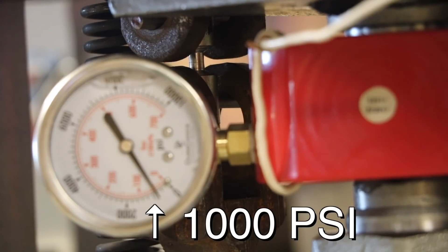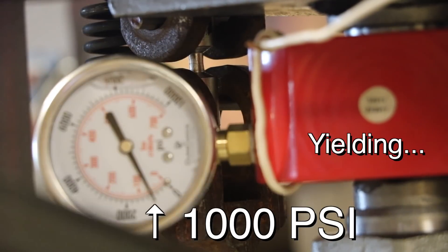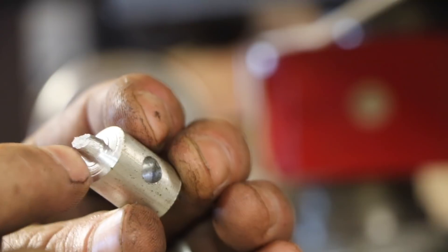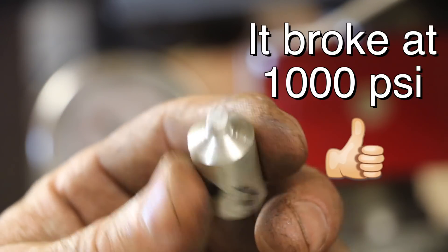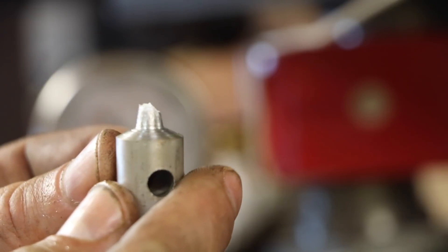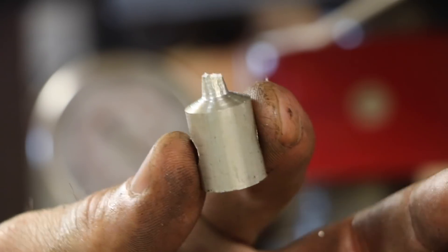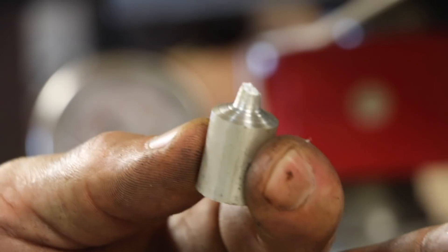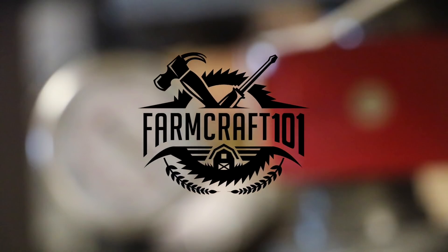It's climbing — bingo! You can see it fractured right there. You can actually see it's a little bit tapered because it stretched before it broke. That worked great. Now I can actually test my castings and see what tensile strength I'm getting. I'm curious to do some testing on my aluminum can material, my bullet brass material — see how strong that stuff is, and how it compares to this 6061, which is what AR lowers are usually made out of. We have success.